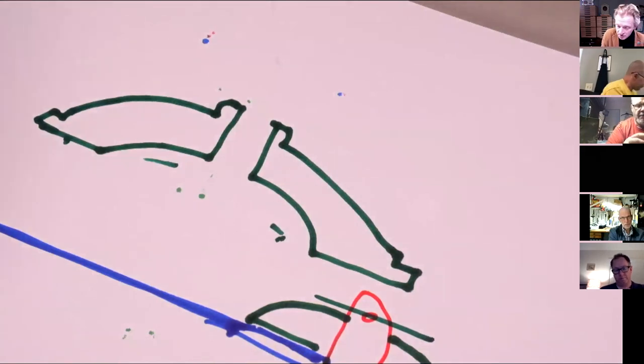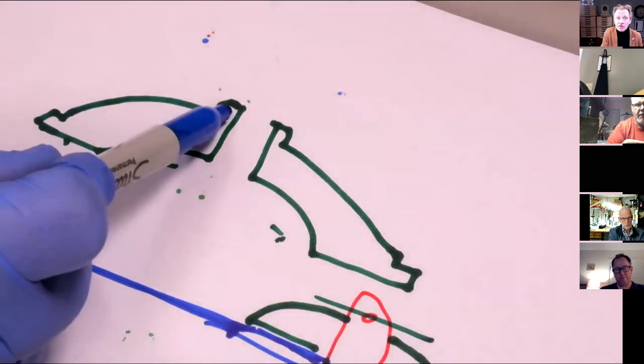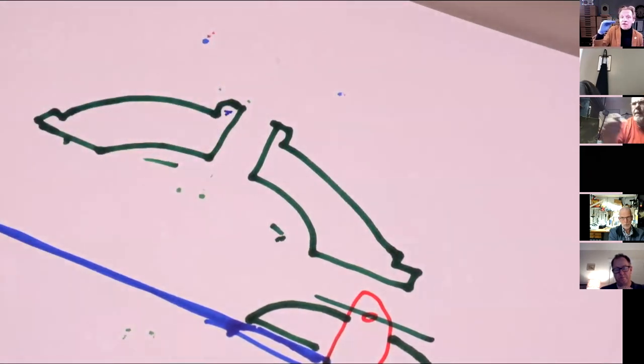I've got this extra little bit here, which is useful, because you can just file it down until you get it to the correct height. Because if you've got the arrangement we've just seen, or the arrangement we've seen many times on a long case clock, where you've got a friction spring, it's really important that that spring is compressed, because A, that's the clutch, but also the pin needs to be in the hole, otherwise the whole thing will fall apart. Okay.